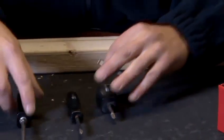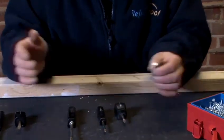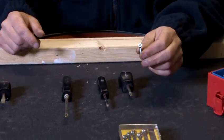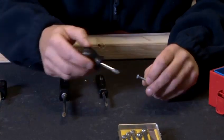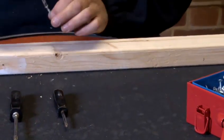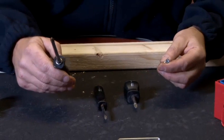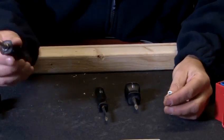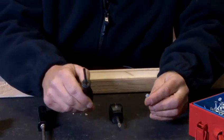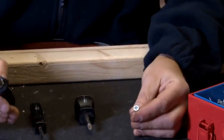So it is important that we get the right size screwdriver for the right size screw. For today's demonstration purposes, we're going to use this type of screw and we're going to choose one of the posi-drive screwdrivers to fit this particular screw. Here we've got a dumpy screwdriver — that's quite a good fit. But because we're not screwing into a hard-to-reach place, we're going to use this type of screwdriver. Let's try this one. That fits. So this is the one that we're going to use.